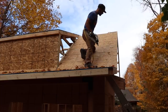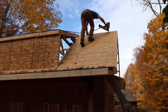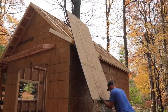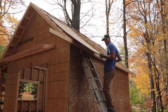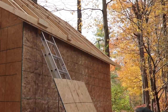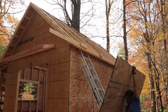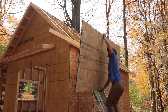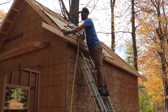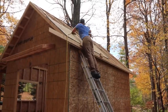When it came to the back side of the roof, that's a whole different story. You can see how little grip I have on this 10/12-pitch roof with these shoes, and the whole back face is at that slope. Getting a full sheet up a ladder oriented like that proved to be a boneheaded move — as the panel flopped over the top edge, it threw me off balance and I ended up bailing off the ladder, only to have the OSB guillotine chase me down. Luckily I was alright, but what a wake-up call to be more careful. I've had offers for help from friends, family, and complete strangers, and I sincerely appreciate the offers — but at this point I look at this as a challenge I need to overcome. I've got this far, might as well see it through.